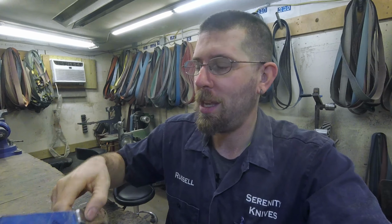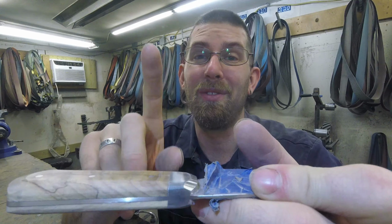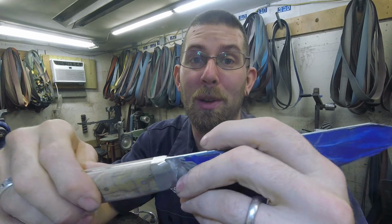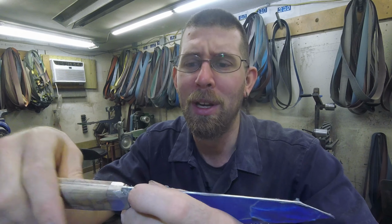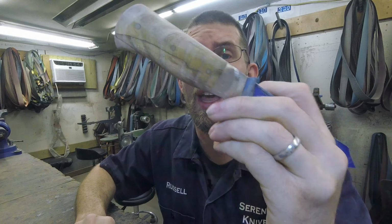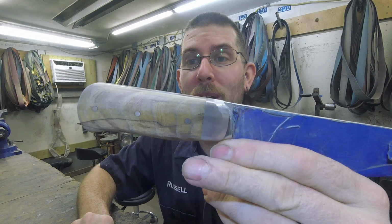What happened is that when you're grinding on 304, this bolster material, it gets really hot really quickly. And when you're only doing four knives, it basically gets so hot you don't want to work on them anymore. And I don't like dunking knives at this stage in water. It won't hurt them, I just don't like doing it. So I grabbed the other three, and so I worked on all eight of them all the way through. So they're all at the same stage still, which is cool, and I should be able to get these all the way through to hand sanding now, and start some Kydex production for these as well.